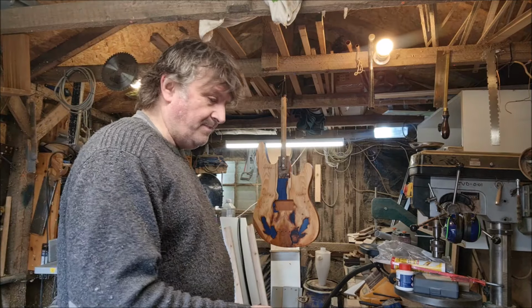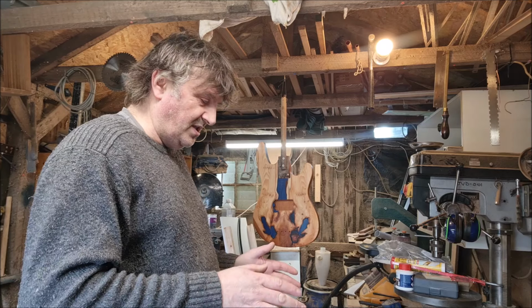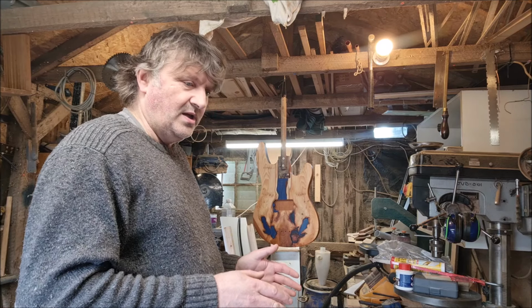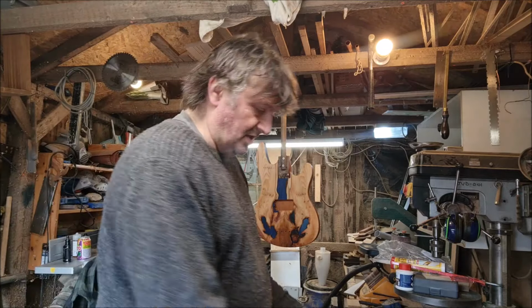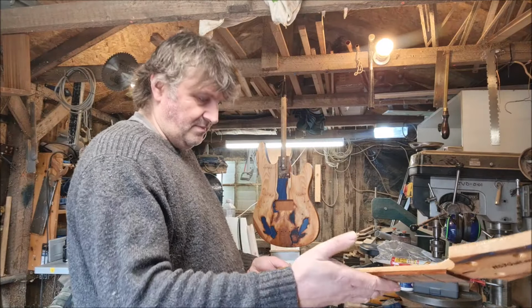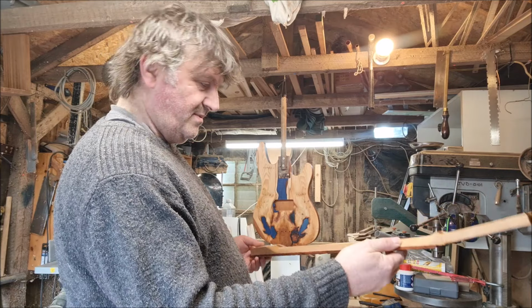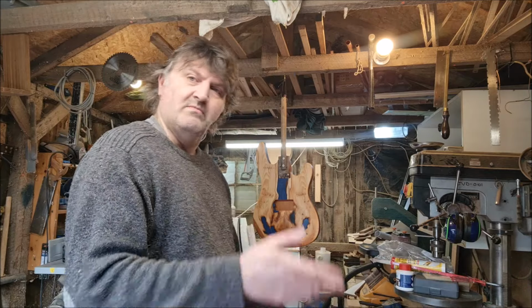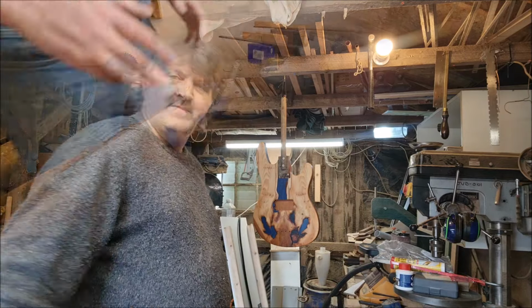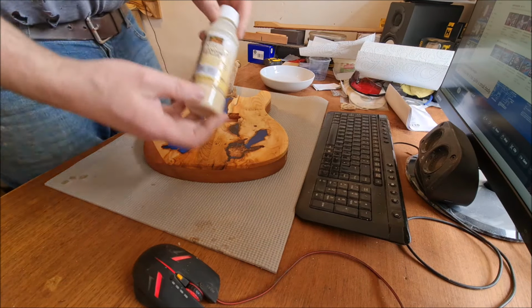The neck, however, I'm going to keep sanding, and then add some more coats of poly onto it, and keep doing that. I've actually just found some really faint file marks there, so I'll get them all sanded out and then add more poly.